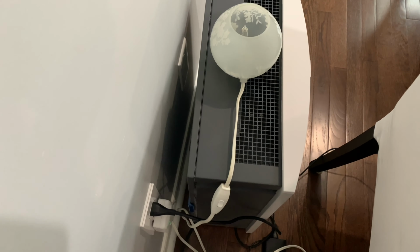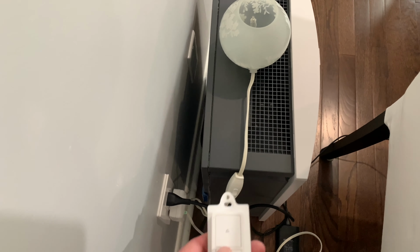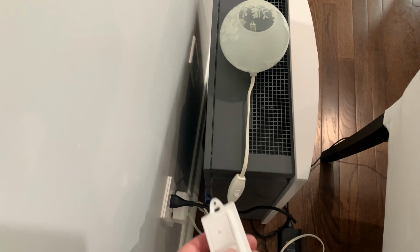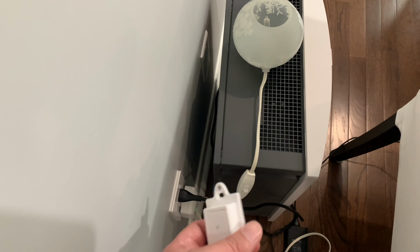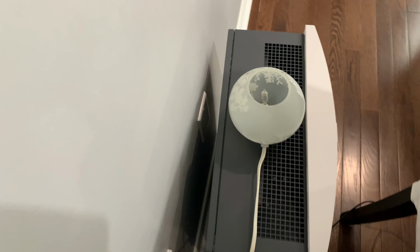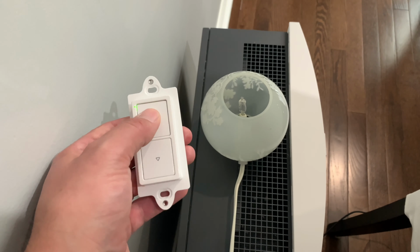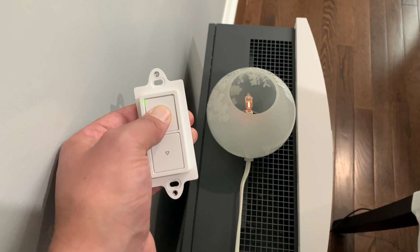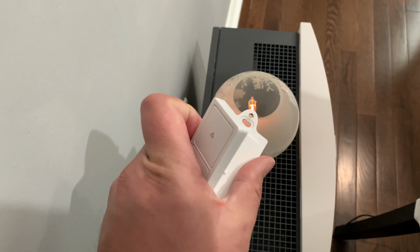So I got it working, paired to the Smartthings 2018 hub, following the instructions. So right now, this remote and that Z-Wave Plus lamp dimmer are connected to the hub, not directly through here. After these are both connected, you join them together with association. And I need to change the Z-Wave parameters on this to tell it it's a very low watt bulb. But as you can see, if I do on, off, on, and here's dim down, it's pretty quick, comparable to the Lutron connected bulb remote or Picos. But yeah, so far so good. So I'm gonna put this thing on the wall next.